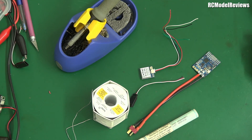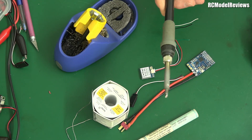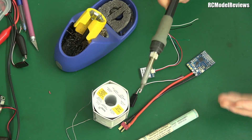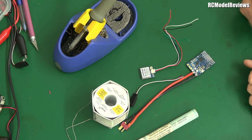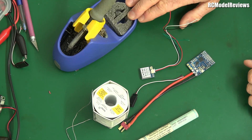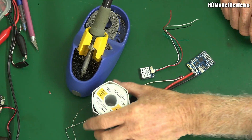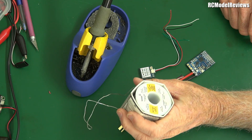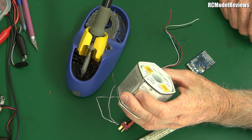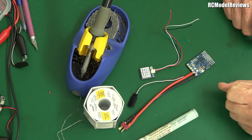Key things: go and watch my video on how to solder. Quick essentials — first, a decent soldering iron. Don't use a crap soldering iron. This whole thing is only as good as the weakest link, and a good soldering iron is the first part. The Hakko is a fantastic investment; you can get temperature-controlled cheaper irons and they'll do the job, but no one ever regrets buying good quality tools. The other thing is decent solder — this Kester solder sent to me by a viewer is an alloy of lead and tin. Don't just use tin solder.